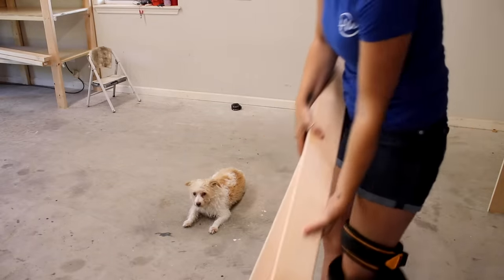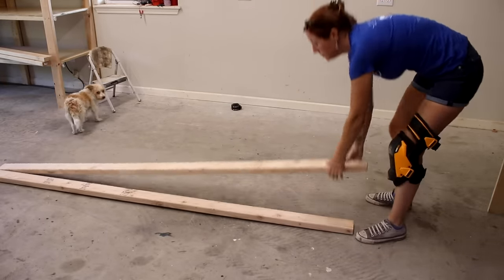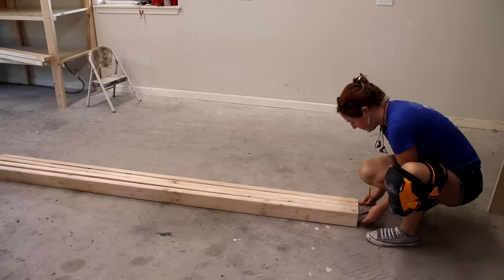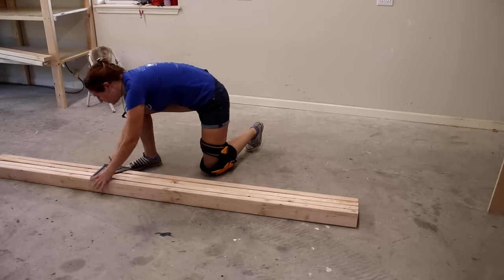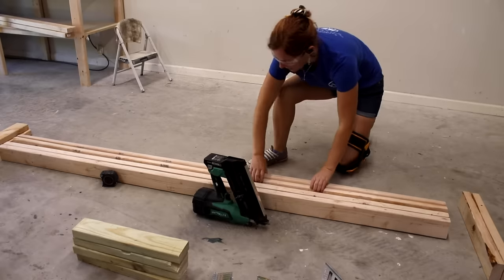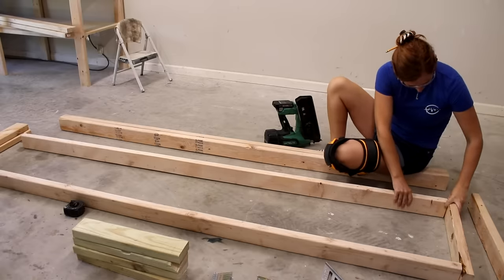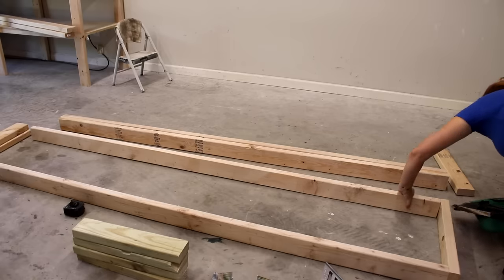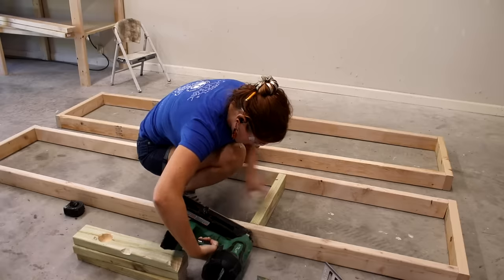First I'll build the two matching platforms that will make up the lower shelf and the workbench shelf itself. These are made up of two-by-fours and since they're identical, I started by laying all four next to each other with the ends flush. This way I could mark the location of the cross members, then transfer the pencil mark to the others in the group. When I separate what will be the front and back of the shelf, I could start attaching the cross members at my pencil marks.